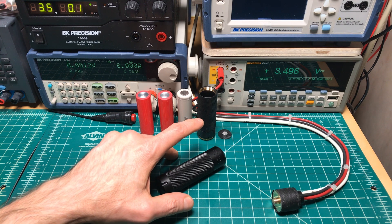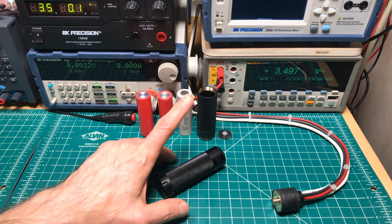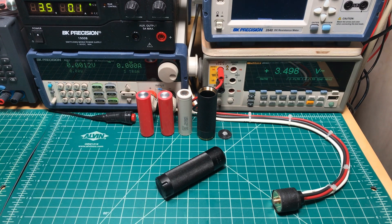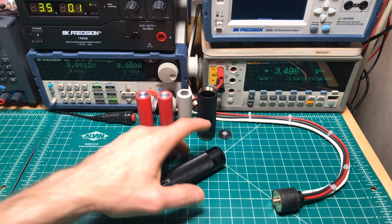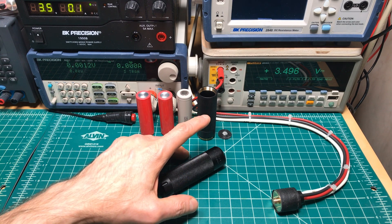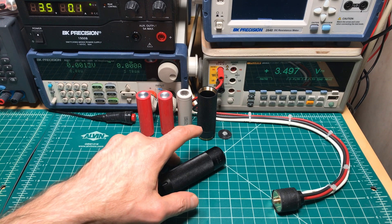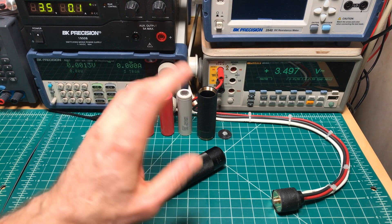The micro photographs I took of the contacts on the first time through — I then took them down with a heavy duty Scotch-Brite pad and cleaned off the contacts as best I could. I won't be showing you micro photographs of those because it wouldn't be fair — for all the mechs I just show what happens the first time through after the first 200 presses.